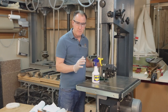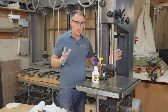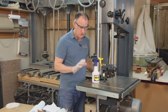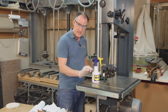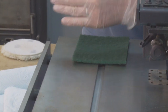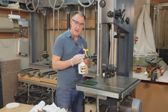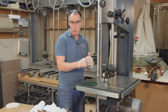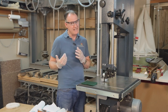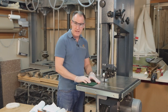Always when setting up a workshop, we want to try and make sure it's as dry an environment as possible. Our workshop is generally well constructed and we have some dehumidifiers, but occasions like this summer you may have a problem. What I'm going to do with this surface rust is just use some WD-40 and a scouring pad and just clean up an area to see how quickly and cleanly it'll look. If I had a much bigger area I might want to use a random orbit sander, but contamination-wise I'd rather do it by hand with a little bit of elbow grease and throw all these bits away in the bin afterwards.